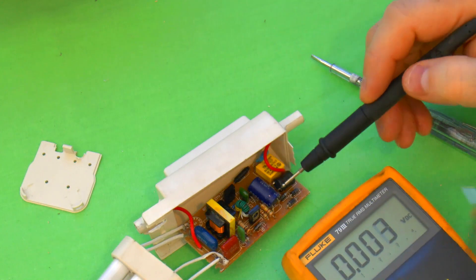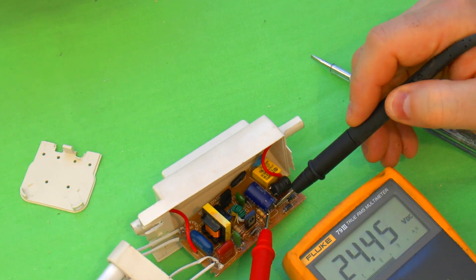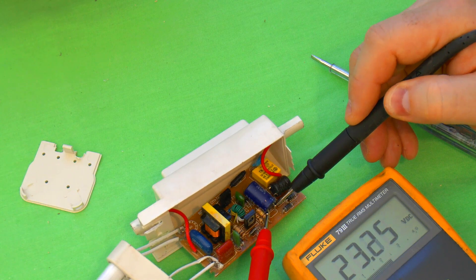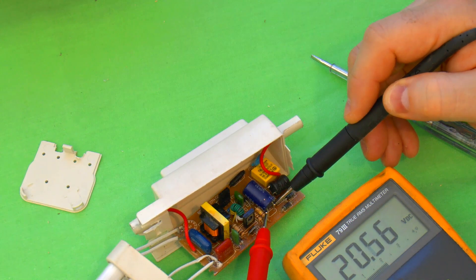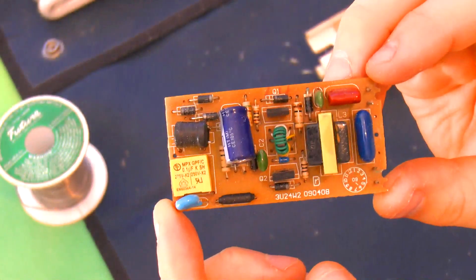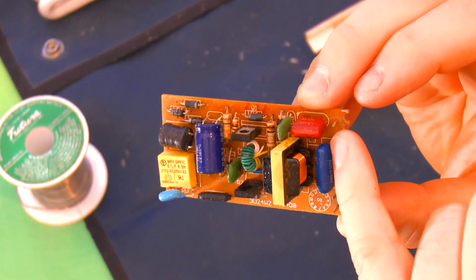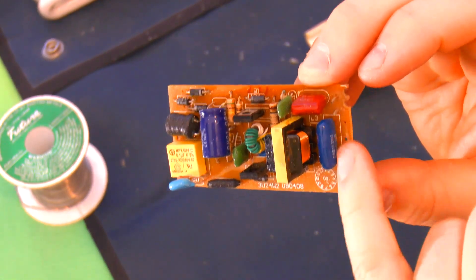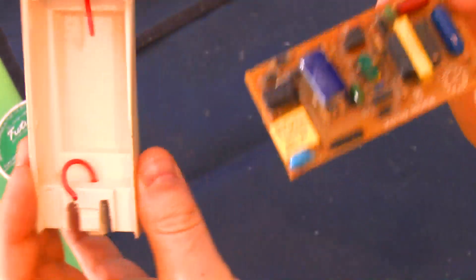It's creeping down — it would have bitten me if I'd gone mauling it straight off. You can see it's been out for a minute or so — it's actually discharging nicely now. Here's the board with the tube itself disconnected from its wire-wrap pins on the end, and also disconnected from the back.